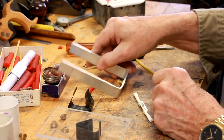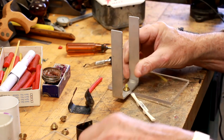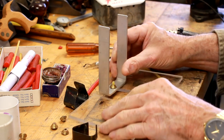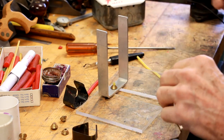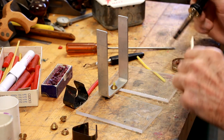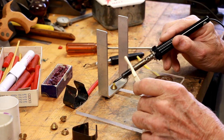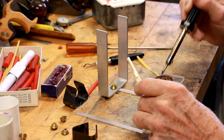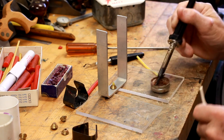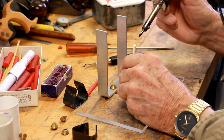This sticky wax will hold the piece in place as I'm pouring the rubber into the mold, but you have to be careful not to pour the rubber directly onto the piece because it's just a very fragile support structure for the part. Here I am melting the sticky wax, almost like mounting a candle to a hard surface.